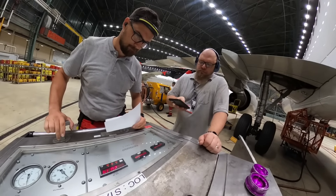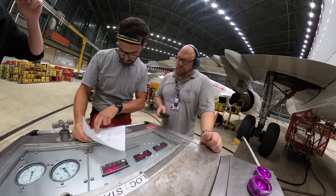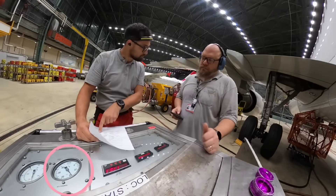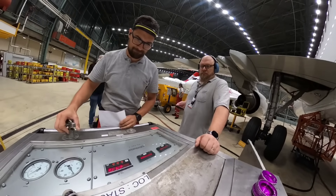If there is a fault on the anti-stall valve, we can observe it on the test kit by a drop in pressure or RPM. We need to be quite fast with the test because the temperature of the hydraulic fluid must not exceed 60 degrees Celsius. As you can see, we are both happy with the values, and I'll reduce the flow back to 0 liters per minute.